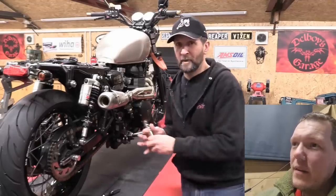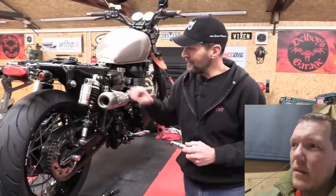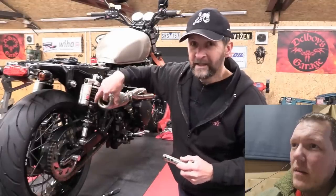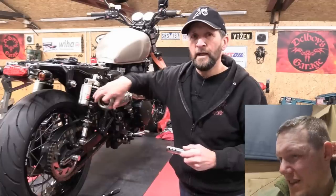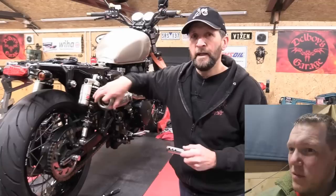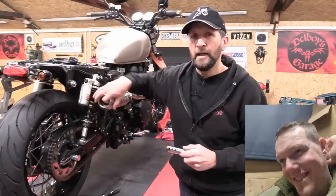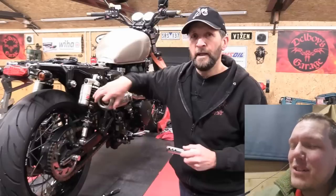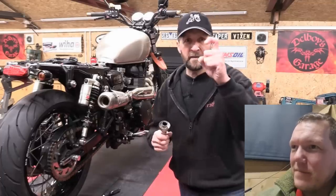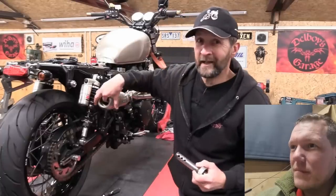Now, if I do that, it means drilling out the rivets, pulling out the back cap, and inside there's that perforated steel tube. It's not really replaceable if you have to drill the rivets out, right? That's like saying, oh, this one, it's welded, but if I get an angle grinder and cut it open, or a can opener, it's replaceable. Replaceable would have fittings that allow you to undo stuff. Rivets are not fittings. And you get a little piece of metal with a hook on it, reach in and just hook it out. Because there's nothing holding that in, other than the baffle.